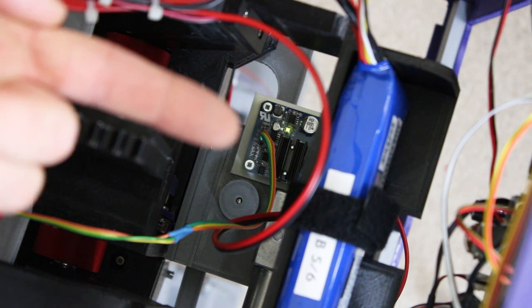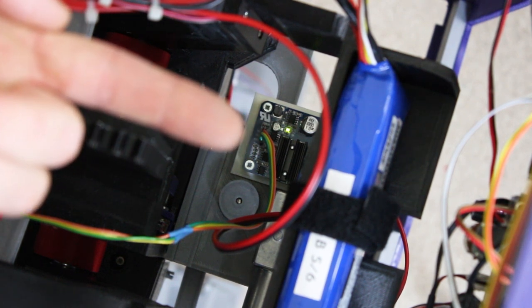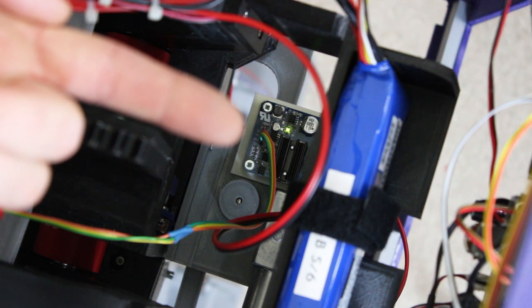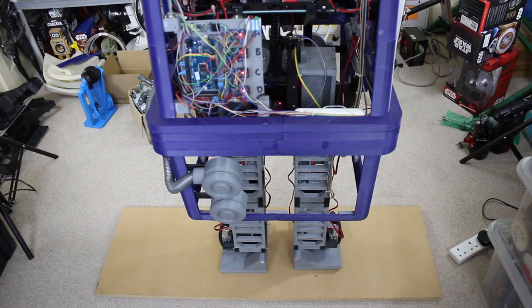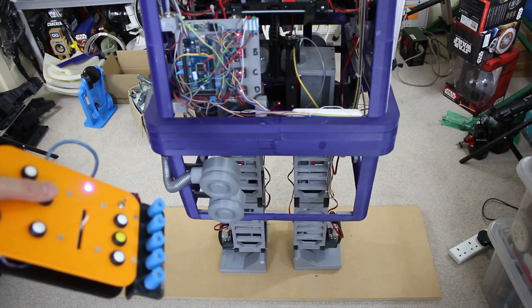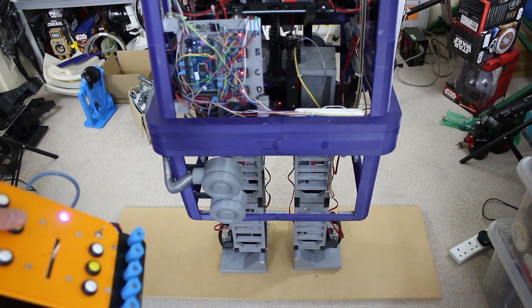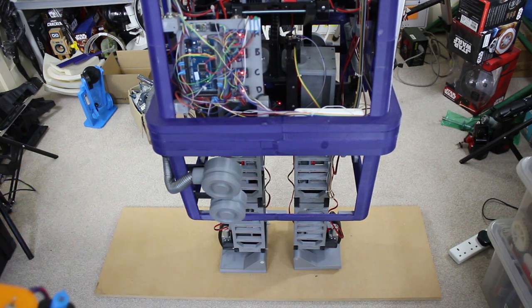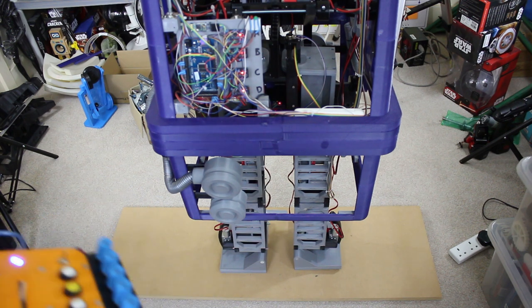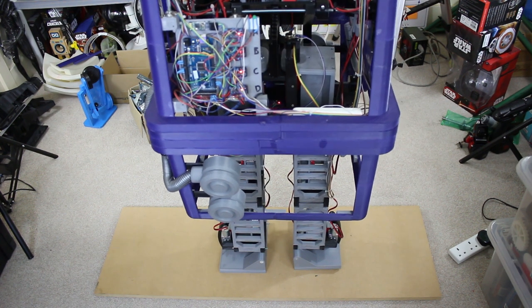There it is - it's got a green light on it so it's getting power, it probably has its own regulator that takes battery power and makes five volts for its logic. I've implemented a bit of code so when I press one of the buttons on my transmitter it spreads the legs, and when I let go it puts it back - that's just setting a flag in the code. Whenever the flag's set it moves the legs apart until it hits a certain position on the pot, and when I let go it sets the flag to zero and moves it back. Basically there's no PID control, it's just ifs.